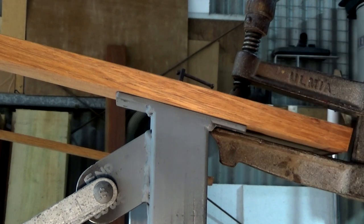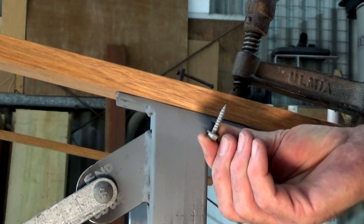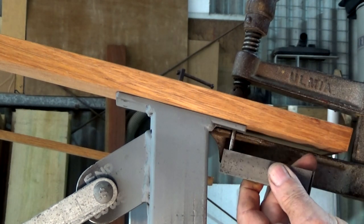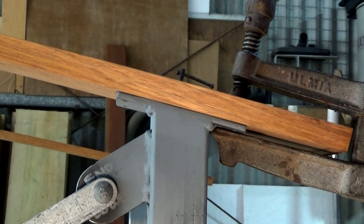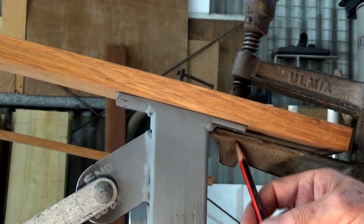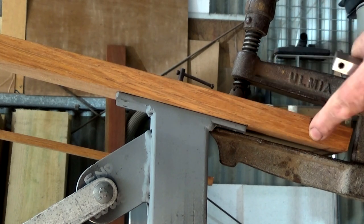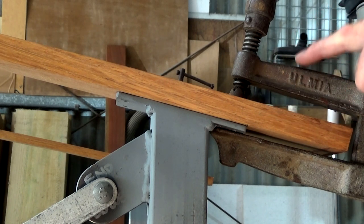I'm a bit worried about the screws splitting this wood — they are a fairly coarse-threaded screw and this wood is a little bit brittle. So I've made a little punch just from a piece of 5mm drill shank pressed into a piece of steel, and I can get that into the screw hole and just tap it up from underneath to mark each screw position. I'll also mark off the end of the plate, cut my timber rail to the correct length, and put a 15-degree taper on the end to match the 15-degree taper on this edge. Then I'll get this all sanded up, screw it down in place, and then laminate the next piece of wood on top.